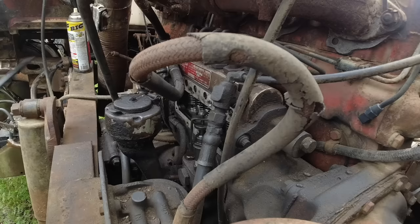You might call them, but I think when you lock it down, that's on the timing of this. I don't think we should move that. I'm wondering if we should move this. That's what I'm thinking. I would say, yeah, me too, for sure. If we move one of the two, I would move this, because there's an arrow gauge up there. I'm looking at it. Was it 22 degrees before top dead center or something like that? You remember? Got to be.